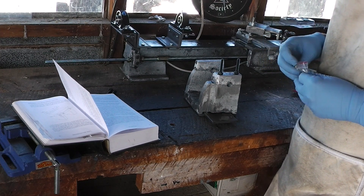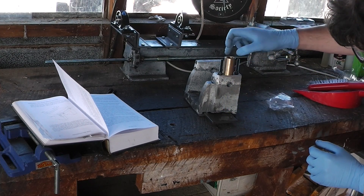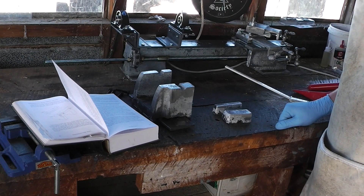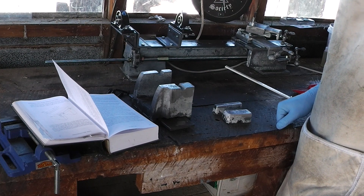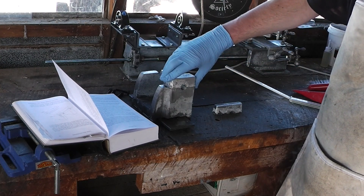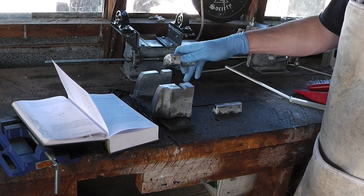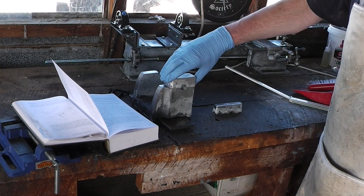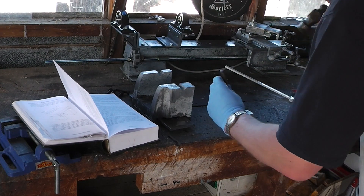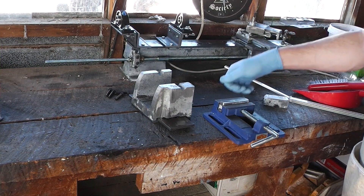These are the bearings I'm going to put through it. The plan is to drill the holes through here first to M8 tap size, then once I have put them on here to about where I'm happy, drill through there using the caps as a guide to make a dimple, with the hand held drill. Then once I've got the dimple, take it over to the press to drill it properly.